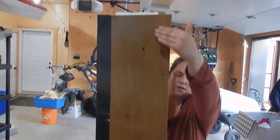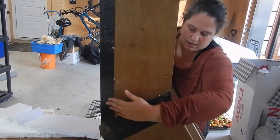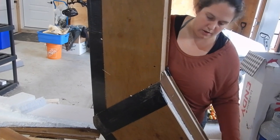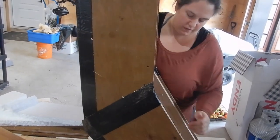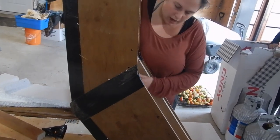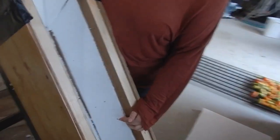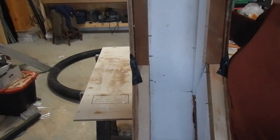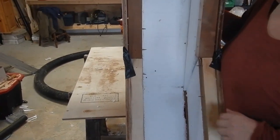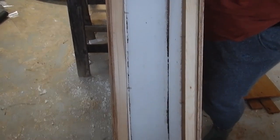So it'll be straight down, about to ground level, and then we'll need to dig a bit of a trench to the rest of the trench, so that it's immersed in the ground. And then the box will continue with the insulation four feet until it can run along the bottom of the trench. Obviously there's a front to this box we've taken off now, so we can spray foam all the gaps and then put the tubing in place. And then we'll seal it up and attach it all.